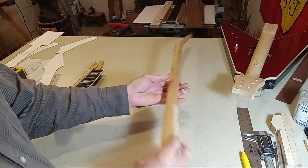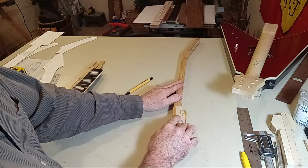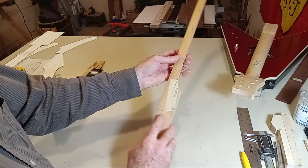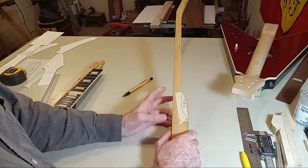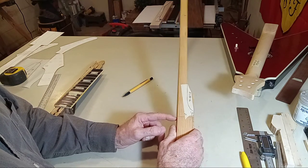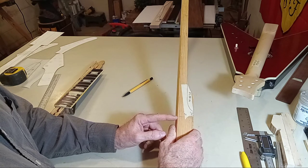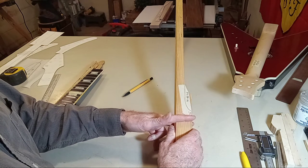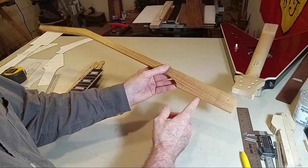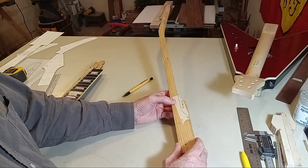If you build yourself this little jig based on your paper drawing, then you simply lay this down and just trace around it. You don't even have to think anymore because you've already done all your engineering based on basically 3 or 4 critical points. The fret location by which you've decided to join your neck to your body, and the pitch angle, whether it's 1 degree, 1.5, 2, 2.5, 3. This happens to be 4.5 degrees for a Les Paul-esque type guitar, small bodied arch top.